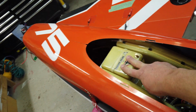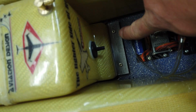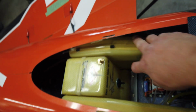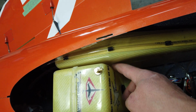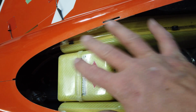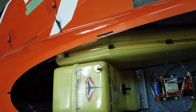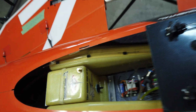So I'm going to take the smoke tank back out. That was just, I put it in just to get the holes drilled for everything. So we've got 2 mounting bolts down there and 2 up top here. So the wing tank is nice and solid. Now the main fuel tanks have a little bit of play, and the back end there can come out. So all I'm going to do with that, when I am 100% done and ready, I'm just going to put a little dollop of silicone in between the 2 tanks on both sides. Now that silicone, if you ever need to get the plumbing system out, all you have to do is take some safety wire, route it underneath, and just slice through it. But that little dollop of silicone is going to keep the tanks nice and stuck in place.